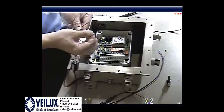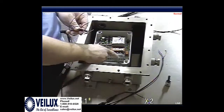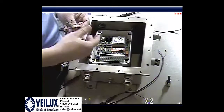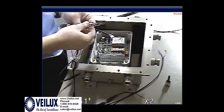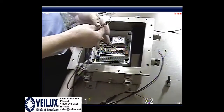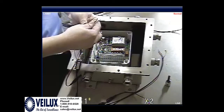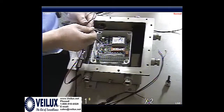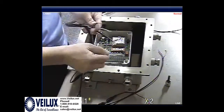You would also use this power, 24 volts, which would be the same power you would use coming into the telemetry to power this telemetry. Remember, this is a 24 volt telemetry system. And then you have some thicker wires, which we read on the explosion proof earlier. For the thicker wires, that red is up, yellow is down, green is left, blue is right, and gray is common.